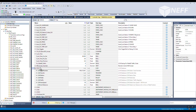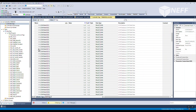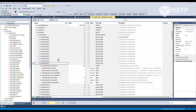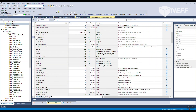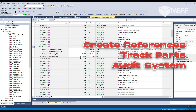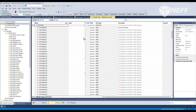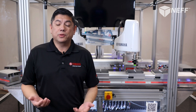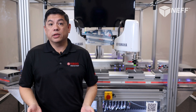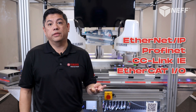Because the skeleton structure is pre-built for you as you import the AOI into your project, through this tag structure you can create references, track parts, or audit your system very easily with LCM AOIs that are provided. We are planning on releasing function blocks for the LCM on other PLC platforms, such as Siemens TIA Portal, or Omron NJ/NX Series in Sysmac Studio, for example. Any PLC software that supports custom function block creation can be supported to run the LCM, with or without custom function blocks, so long as it can communicate via a standard fieldbus such as Ethernet IP, Profinet, CC-Link IE, or EtherCAT IO.